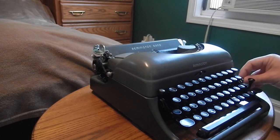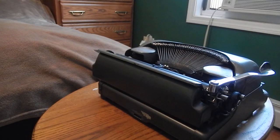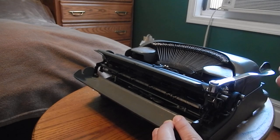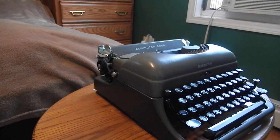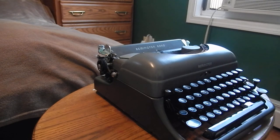You have your switch over here for your ribbon selector. When I say tabulator, this is, as I've read, a true tabulator. The serial number for this machine is BT 1616496 — the T in the serial number apparently denotes that it has a tabulator. These are actual settable tab stops. Normally these Remington portables have a paragraph key or self-starter key which only advances the carriage about five spaces each time. I guess this tabulator was a feature most people didn't opt for — most of the ones I've seen online have the self-starter key — so having one with a real tabulator is quite interesting.